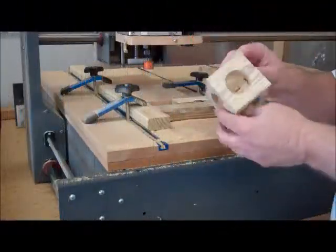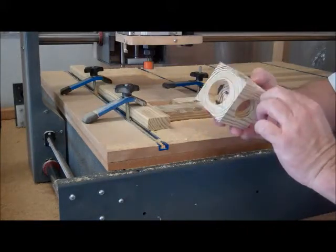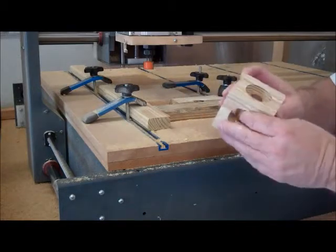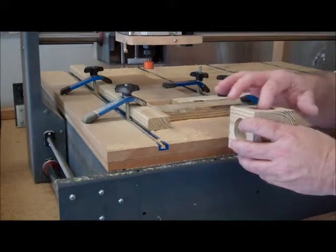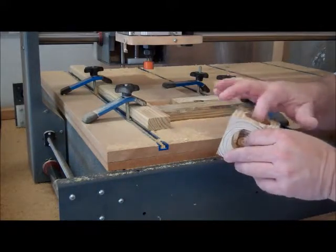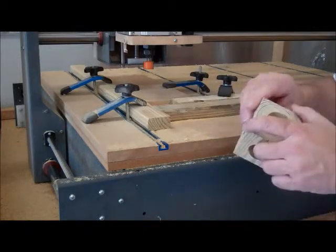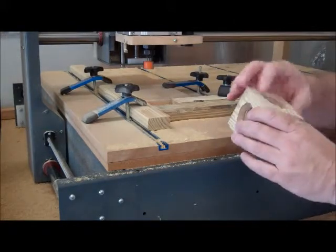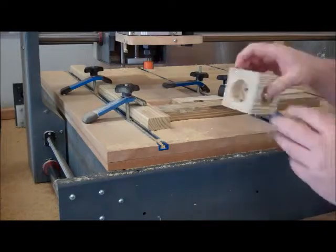You can see now that I've got all six holes plunged in there, and I've still got the cube being held in there with enough material that I can actually put a very small quarter inch 60-degree V-bit and engrave something on the sides of this cube before I cut it free. So I'm going to change my tooling out and program something to go on the sides, and then we'll cut that engraving in there.